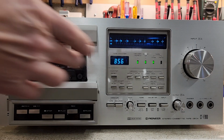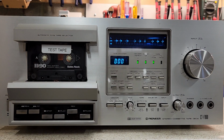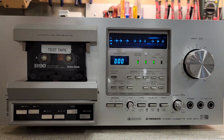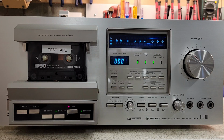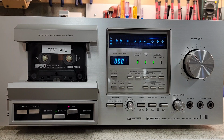I'm going to go ahead and record a selection. We'll keep using the same selection that we've got here, and see how that sounds with a chrome tape. Now the bias fine is going to act differently, and we'll see how that works in just a moment. So let's go ahead and put the pause on, get ourselves ready to go, and start the music now after the leader.